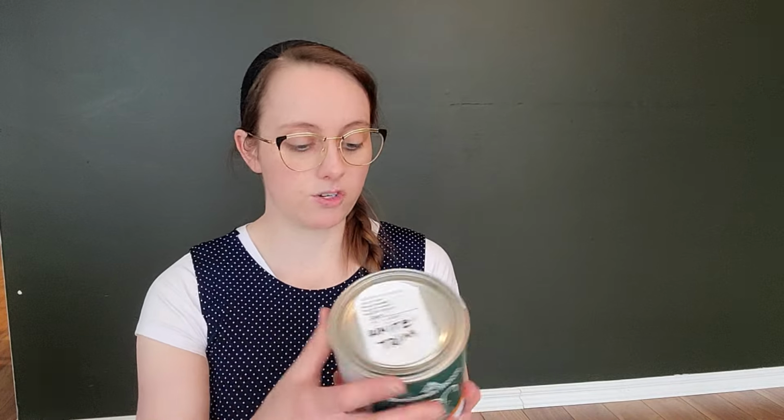Okay, as I mentioned, I'm gonna fill the nail holes on the baseboards and also caulk the tops of the baseboards. And so I also want to paint the baseboards after I've done that. And for that, since we do not have real wood baseboards and they are painted, I was kind of worried that some of the paint would not stick because they're very glossy and a very smooth finish. Waterborne bonding primer. And he said that this bonds to pretty much anything glossy. So I bought the primer to do my baseboards and then just the paint.